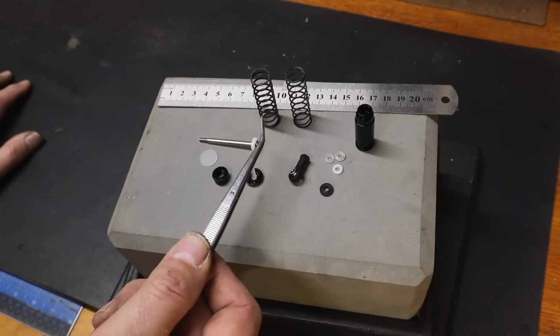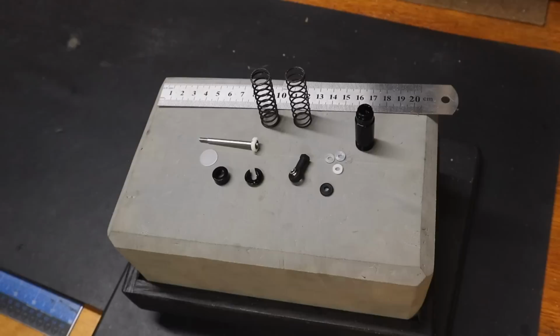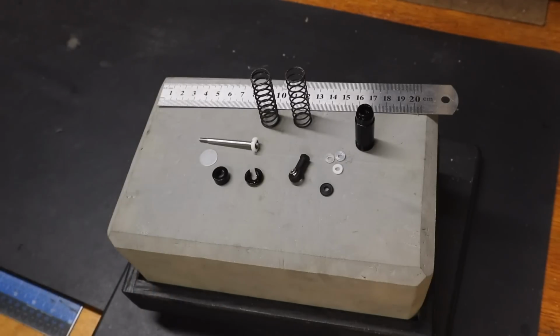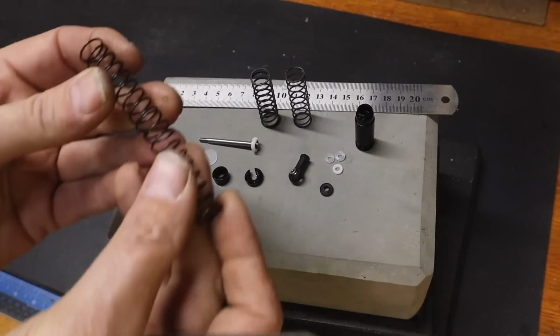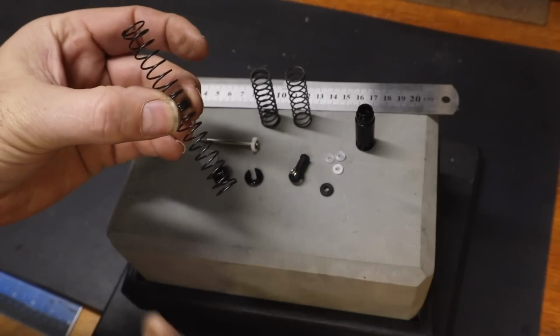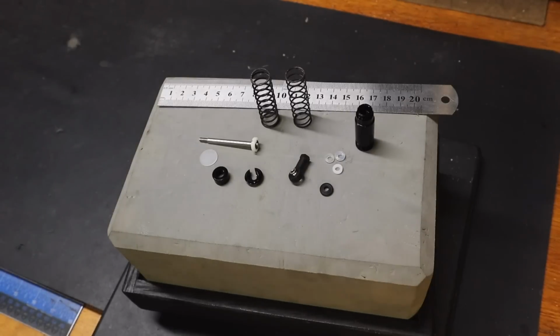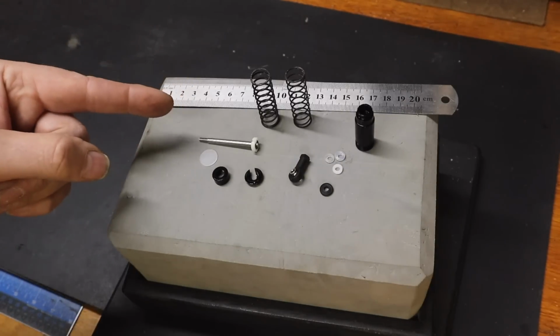The firm spring, at its 47mm length, and its 9 coils, is 7 pounds per inch. 7. That's ordinarily the kind of tension you would expect from a spring that is meant to be run stacked, because if you run 2 springs like that stacked, it halves the rate because you just doubled the number of coils. So that is very firm.